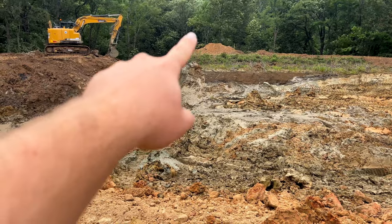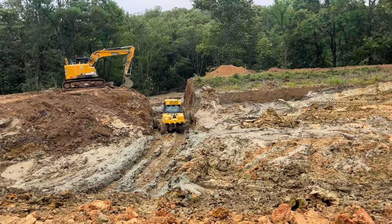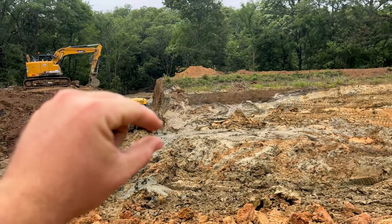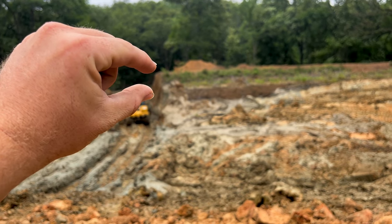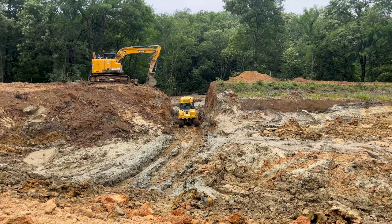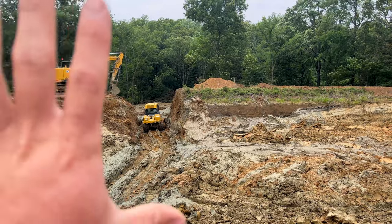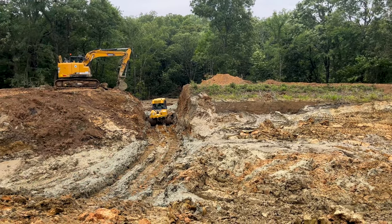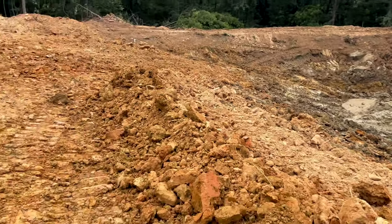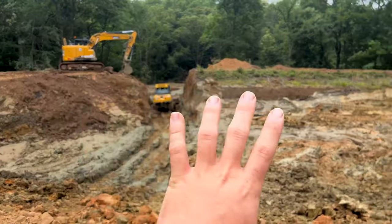As we dug our trench, one thing we were looking for was, how good is the core of this pond? And we noticed that although a very large section of the core had clay, there was a little bit on the bottom, and about the first 4 to 5 feet of the top of the dam didn't have any clay in it. Now, that raises some concerns, because if there isn't that clay, this pond's not gonna seal through the dam. You're gonna get seepage in your dam. And then if there isn't clay on the bottom, they're gonna get seepage down there on the bottom.